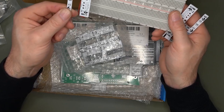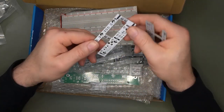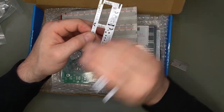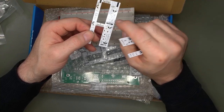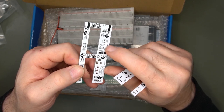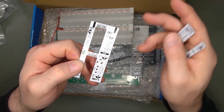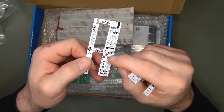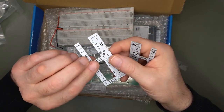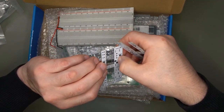That way you get a more stable power. I think you have ground on one side and VCC on the other, so it's spread out. It's not just one trace. The only traces you see, I don't know if you can see it here, are just for the LED, to go from the dropping resistor to the LED, and also from the barrel to the switch. Other than that, the whole PCB area is power and ground on one side and the other.